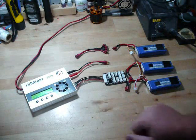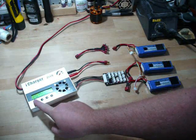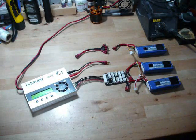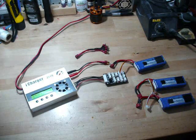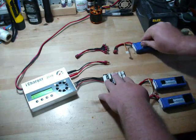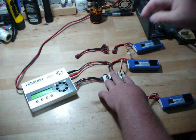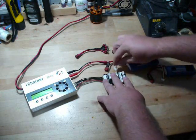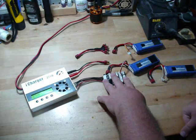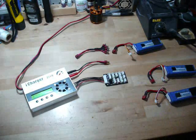Anyways, let me plug my charger in — there's my 208. I just charged this pack at 1C. First of all, I'm going to enter monitor mode and show the battery balances. Let's plug this battery in — we'll find that it's at 4.19, 4.18, and 4.19 volts. It is charged. Battery number two is 3.79, 3.79, 3.79, which is about 65 to 70% discharged, what I usually run my T-Rex Pro. And this one's at 3.8, 3.79, and 3.8. So there they are — three packs.